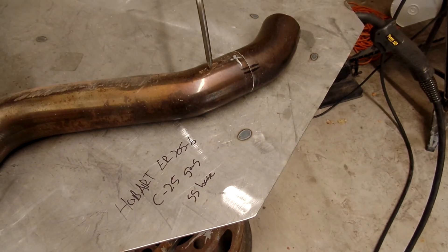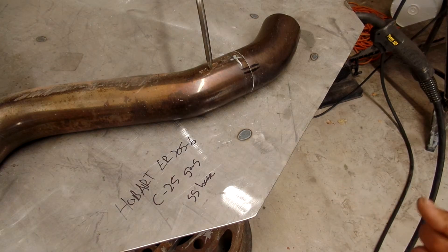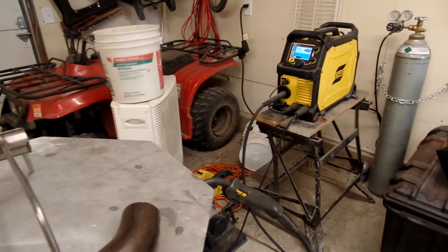Technically we should be welding this with a material close to or a little higher grade than the base material. If I'm guessing, this is probably 304 stainless, so we would probably weld it with a 308 or a 309. If we were doing steel to stainless steel we'd want like a 309, 310, or 312 grade filler metal. You can weld steel to stainless and be fine — it's not as big of a deal as some people make it out to be. So we're going to be welding today on the mighty ESAB Rebel 215 IC.